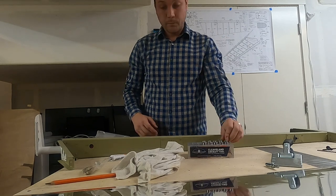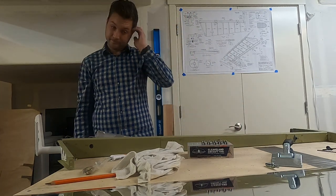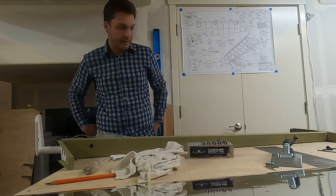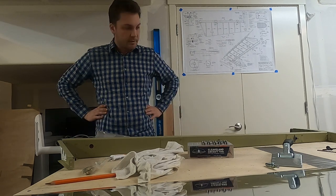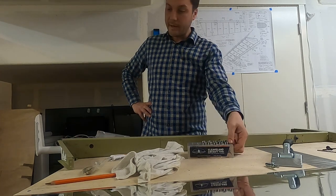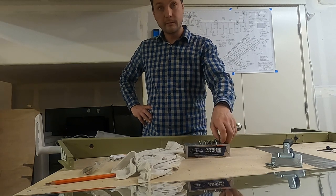I just went to put this in the skin and realized it's not dimpled. I think this goes back to when I really just wanted to rivet something and I skipped some dimpling. I dimpled parts of it, everything that needed to be dimpled up until now, but none of this is dimpled. So I've got to do that, but now that it's riveted together, I think I made things really hard on myself. We'll figure that out now.